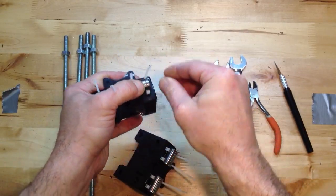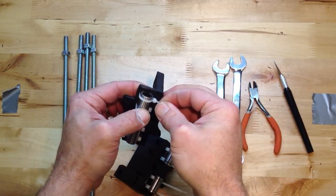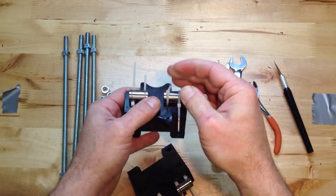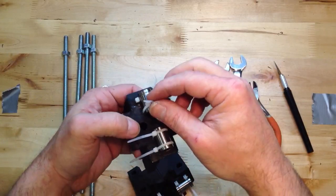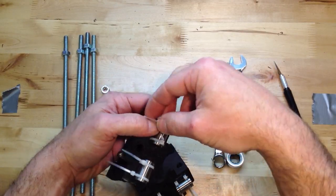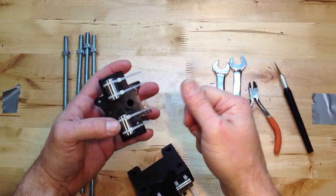We've got our zip ties in. Now we can pull that up a little bit and zip tie these closed. I don't like to go crazy on these — I like to get them snug. There will always be a chance later to get them even tighter, but we're just trying to put this thing together and there's plenty of room for adjustment. These holes are pretty close to the bearing, and on the LC's — the wooden ones — I've actually broken the hole in between there because I was pulling too hard. So you don't have to go crazy; just get it snug for now. I don't like to tighten them down until I have a smooth rod put through here to hold them really straight when I start cranking on them.